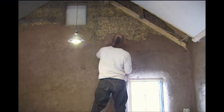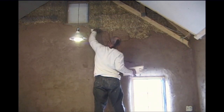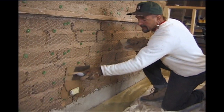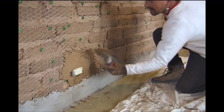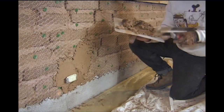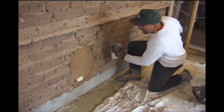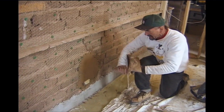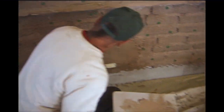The inside is at an advantage where, without the sun baking the mud and drying it out fast, it'll stay wet for three to seven days. That means you can keep working on it day after day. Whereas with gypsum plaster, Structolite, or any of those finishes, you've got 20 to 30 minutes — you can't even take a coffee break. It can be a nightmare sometimes.